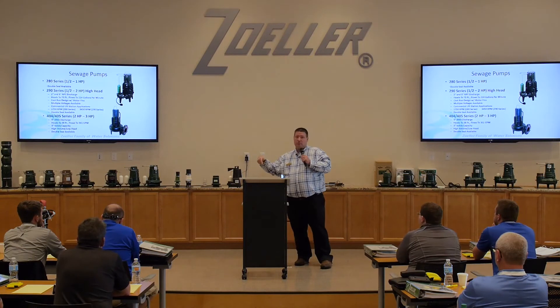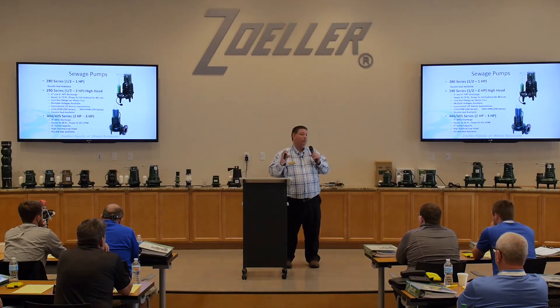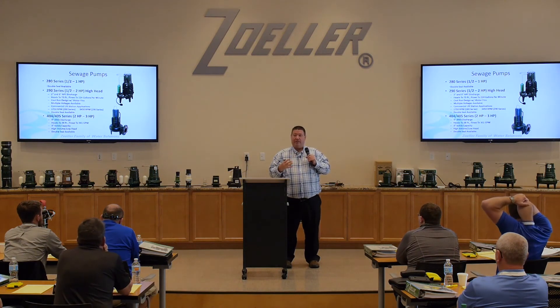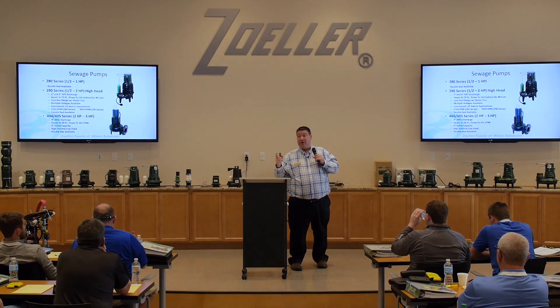Sewage pumps tend to run a little hotter because there's stuff passing through — actual debris and solids and things like that running through that impeller cause added wear and added drag on that impeller. What happens in an electric motor when you have drag on that impeller is the amps shoot up. Electric motors are electric motors — they're still going to try to work the same regardless of any obstructions. That's where amps start to rise and fall. A sewage pump especially, because there's sewage and debris and all the other stuff that goes down the toilet, and the pump's still trying to run but it can't because something's jamming it up — eventually it's going to generate a lot of heat and burn itself out.